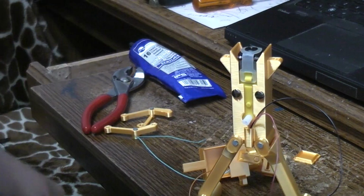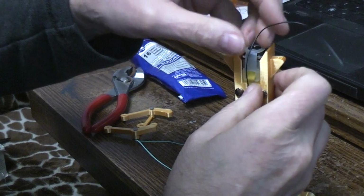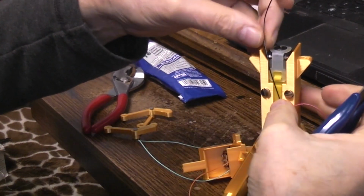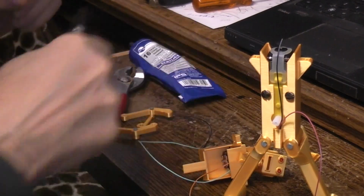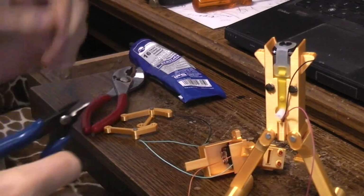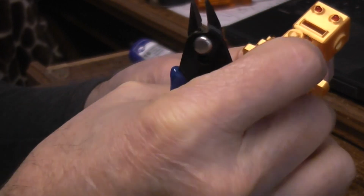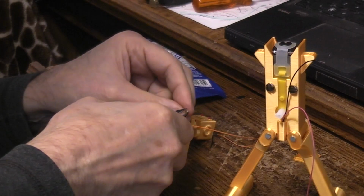Okay, so speaking of wiring, I'm going to bring up these wires on the back. You can see the black one, I'm just going to go ahead and plan on it running right directly to the motor. The red one will run through the switch. Again, I could just try to cut and make this go directly there, no extra, but what if I screw up? So I'm going to purposely leave some extra wire on the black so that I can wad it up in that backpack part that I just showed you, in case something goes wrong and needs a little bit more wire than I thought it was going to. In the case of these LEDs, I think I made the green my negative, so I'm going to make sure I leave some that I can wad up around in there and then go to the motor, because it's going to make it a lot easier to solder if you're not trying to pull these things taut to each other.